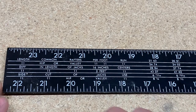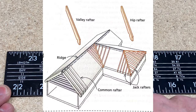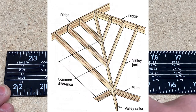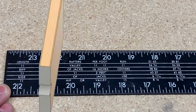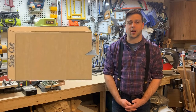The other lines of the rafter table help builders figure out similar information, such as the length of a hip or valley rafter, which run at a different slope than that of the rest of the roof, or the difference in length of hip and valley jack rafters. The bottom two lines help the builder to set the framing square to the right angle to make the side cuts on the hip and valley or jack rafters.